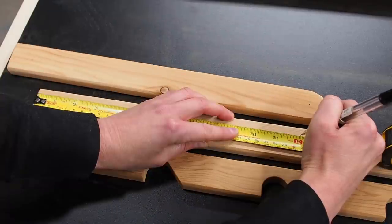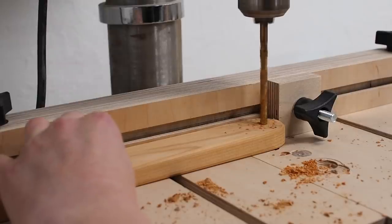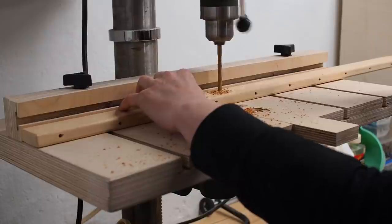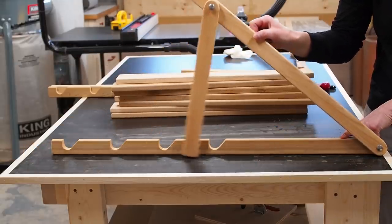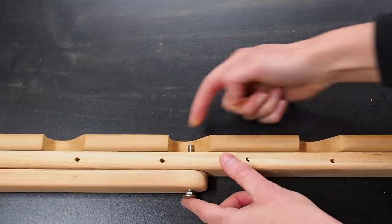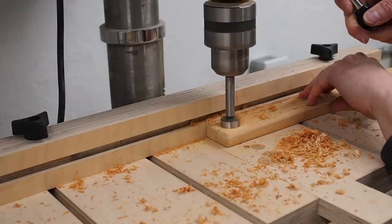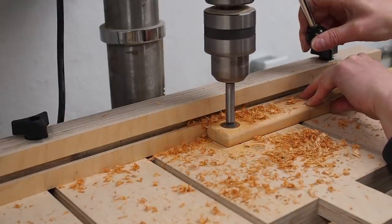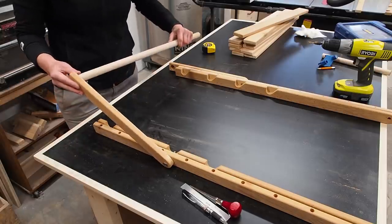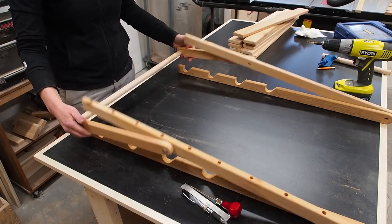The third piece of the mechanism is the swing arm that allows the back to be adjusted. I started by making the bolt hole so I could assemble both arms and tested it out. You want to make sure the bolt falls into one of the hooks so the wedge will be able to fold flat. I'm going to use a large dowel to connect both arms, so here I'm using a Forstner bit to make a countersink hole the same size as my dowel, making sure not to go all the way through. I did a dry fit to check that everything was good.